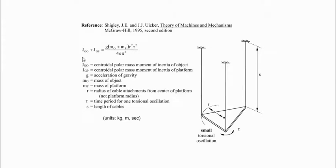I was also looking at the formula for calculating moment of inertia when we do a measurement. The moment of inertia equals gravity times mass times r squared times the oscillation time squared, over four times the string length times pi squared. I thought it would be as simple as: if I changed the mass by removing one rotor, the moment of inertia would reduce proportionally — half the mass, half the moment of inertia. But then I realized the oscillation time might change, and it's squared, so it's not as simple as just reducing the mass. I would have to reduce the mass, put it on the rig, and measure it.